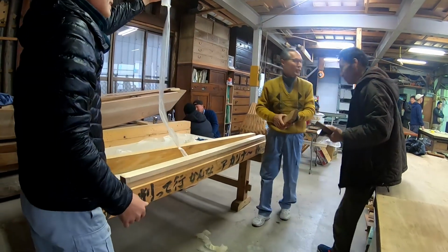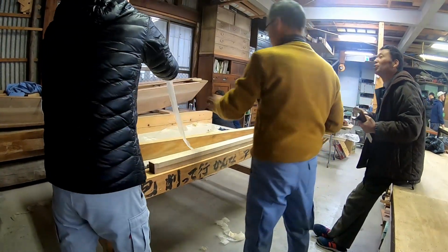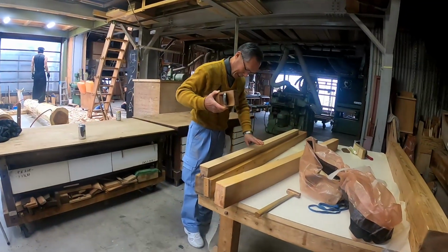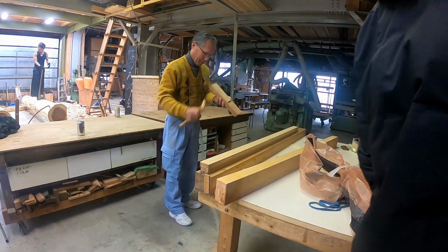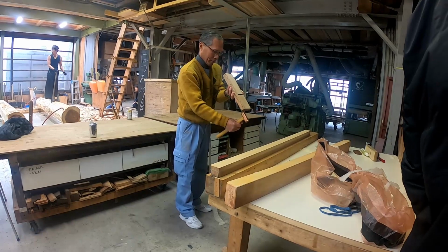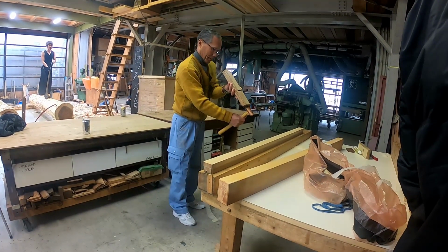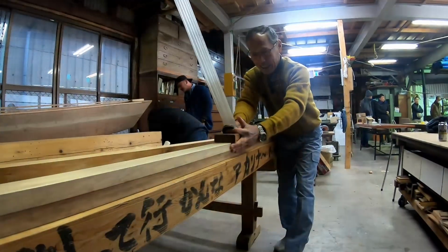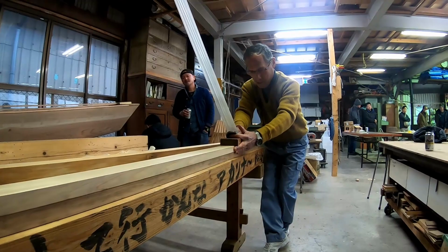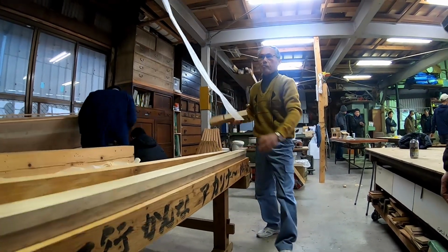And when they cut the wood fibers with such a clean cut, they resist moisture penetration, and it becomes sort of like a mirror, and you don't even need an additional finish to complete a project. I actually brought a small super surfacer back from Japan, a machine that attempts to automate the hand planing process. It moves wood along a sharpened blade, but for the absolute peak finish, there's really no comparison to a properly tuned Kanna wielded by a master.